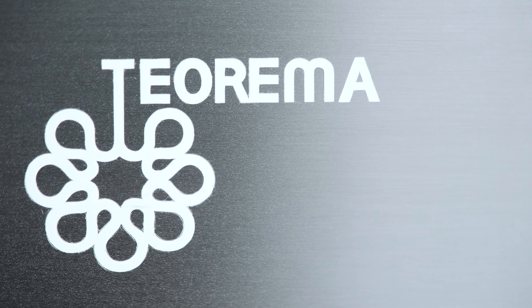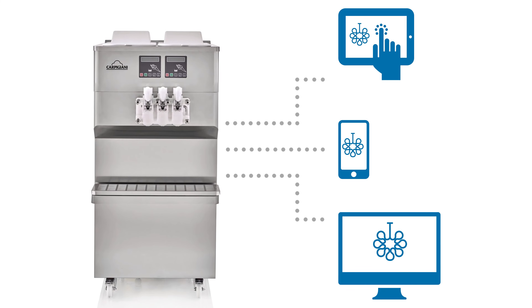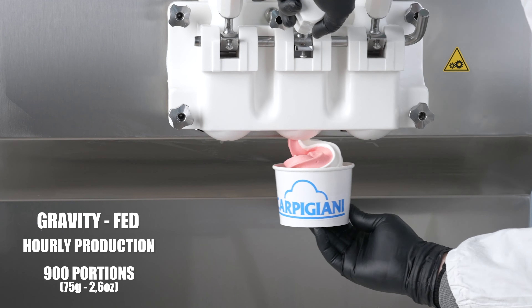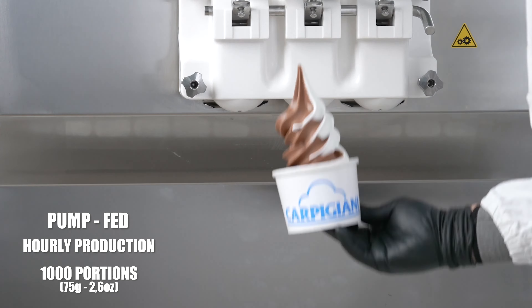The pasteurization and mixed storage programs can be set to automatically run at a convenient time for you, such as overnight, in order to be fully functional the next day. With the automatic self-pasteurization system, you can choose when to wash the machine up to a maximum interval of 42 days. As a further guarantee of hygienic safety, if the operator does not perform the complete cleaning at the end of the set days, the machine goes into automatic block.